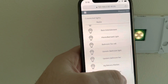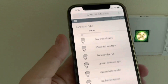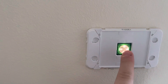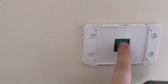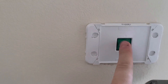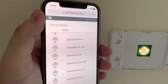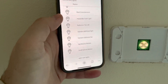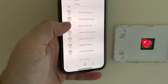To add lights, you need to put the device or the switch into Zigbee mode. To do that, you've got to push it 12 times at a consistent rate. So: 1, 2, 3, 4, 5, 6, 7, 8, 9, 10, 11, 12. You should see it flick — there you go, it's now going to reboot into Zigbee mode.